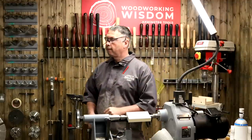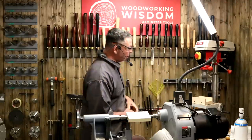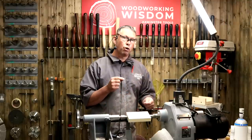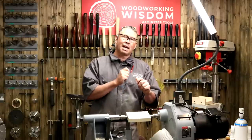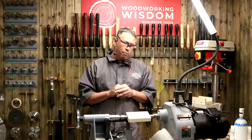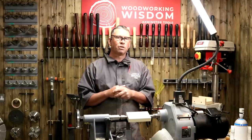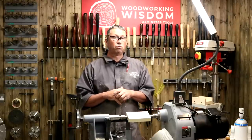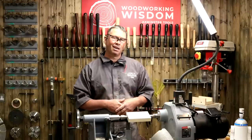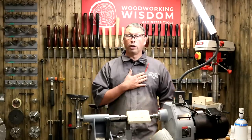And then a question from Cliff. Why choose those particular pro drive and live center? I find them easier to work with. Because the pro drives have a sprung center, I'm not having to fiddle around with tapping things in. Like a four-prong drive or two-prong drives, you have to tap things in. With these you don't. So I find they've really saved me a massive amount of time since I've started using them. They're my go-to drive centers now over four-prong drives. I find they don't clog up as quickly. They're a better drive, a little bit more accurate as well. So that's why I use them.